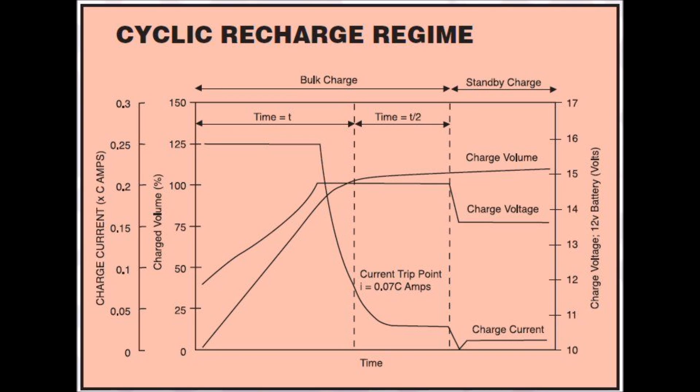Next, we'll look at the charging program of a typical 12-volt battery. If you're going cross-eyed right now, that's for good reason, because it's actually a fairly complicated program. It depends upon the discharge state of the battery. There are various voltages and various currents that it will use depending on the charging state. That's what a charge controller does — it manages that process. If you just have a solar panel connected to a battery, you don't get any of that intelligence. All you're doing is producing the load voltage, roughly 17 volts, and that's going straight into the battery.